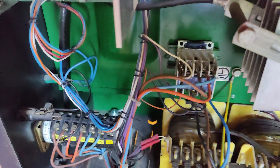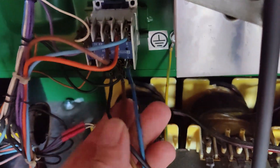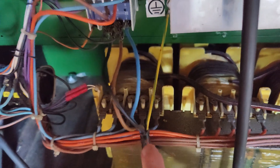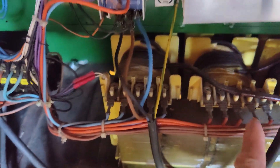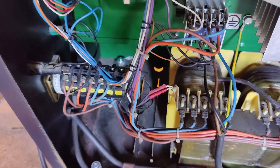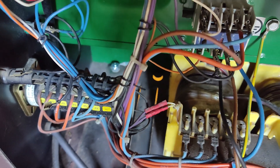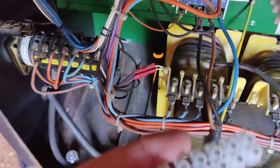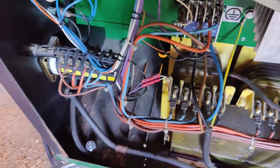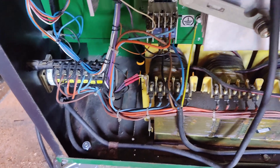I need to take that one out and hotwire my power supply which comes in here — L1, L2, L3 — into the separate units at different places and connect it up here. It should have been a nine-pin power terminal if it was built like that. This is what I have: a six-pin, and I actually need four but will probably use a bit more.